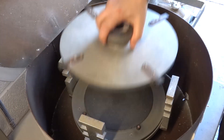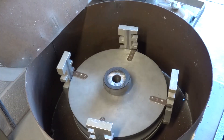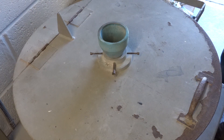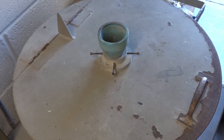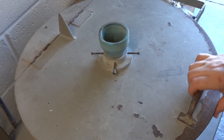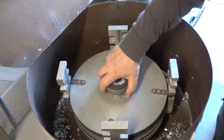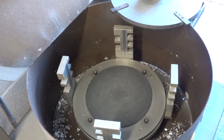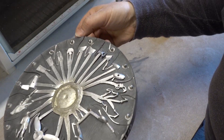As before the molds are spun but this time at a higher speed and a higher metal temperature to get the metal to flow into the detail. If you spin too fast or don't have enough pressure holding the mold together, molten metal can spray out of the mold like this. It's an inconvenience but not a disaster. Everything is cast and you can see where the metal has escaped from the mold down the air vents.